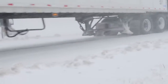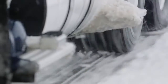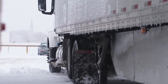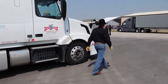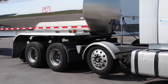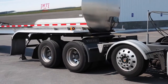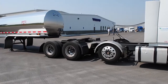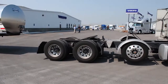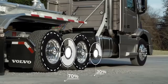My drivers did not take off on this project very well-enthused — they were absolutely, without understanding it, did not like the concept of losing their twin-screw drive versus a single drive in a lift axle. But once I got the drivers in them, once they drove these trucks, you cannot find a negative aspect about it. They drive so much better empty. The traction is so much better from a safety standpoint. In the wintertime especially, if you're in the north and driving snow, after you've driven one of these trucks, you will not want to climb back in a twin-screw truck. The traction is so much better.